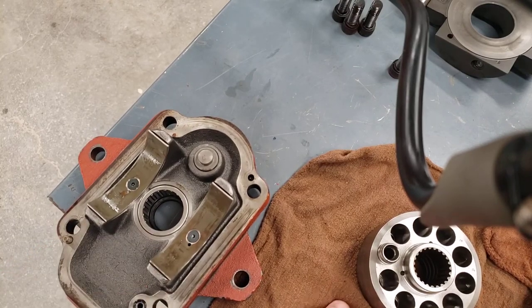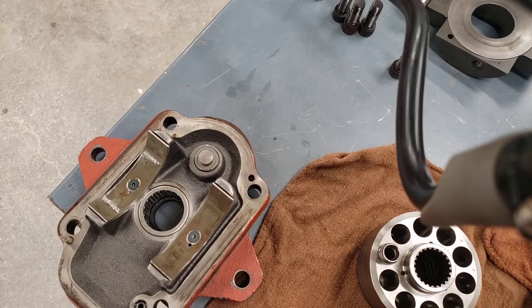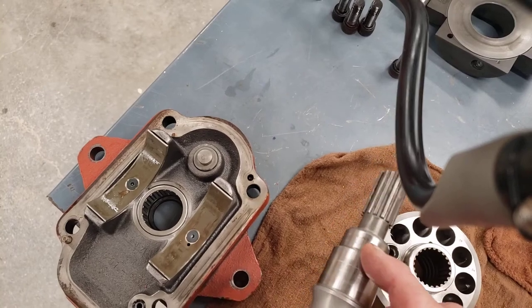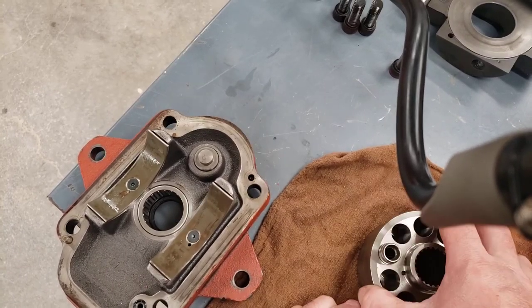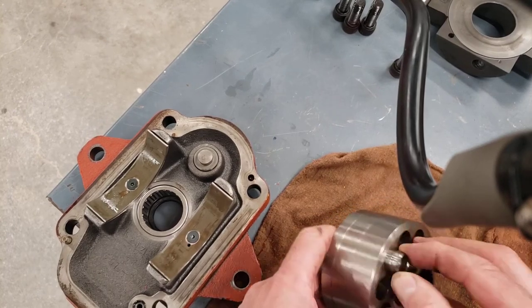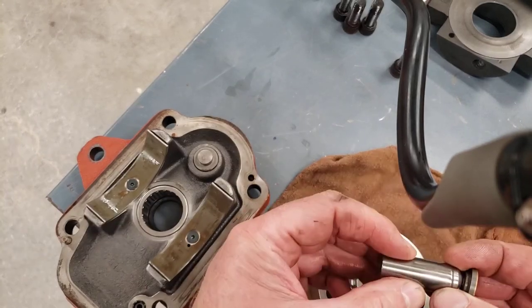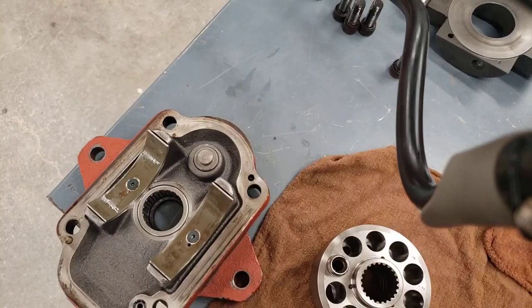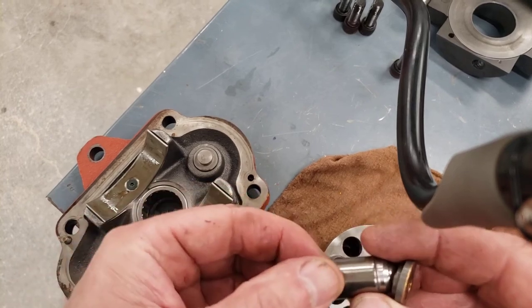Or someone's been adding oil to the system and not paying attention to the cleanliness of the oil, or the funnel, or the tools, etc. But this one doesn't look drastic, so it seems like it was a very short duration that this pump had dirty oil in it, but just the wrong size particle gets in there and the pump can lock up. I don't see a lot of sandblasting on the pistons themselves either.